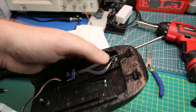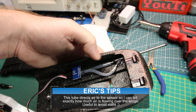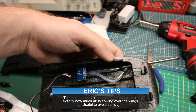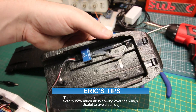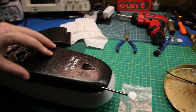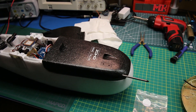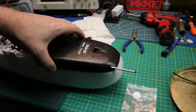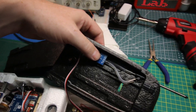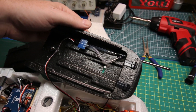Tiny little bit of hot glue on the leading edge — that way if this punches through it doesn't have to punch through the glue and it should just pop back and pop both of these off, or just move the tube back. Should be somewhat crash resilient. If it's on the nose like so, it looks just like a real plane — nice little piece of pitot static tube sticking out. Very cool. Don't know whether I've got the lines on the right way though; they're not labeled which one is the static port and which one is the straight-through port.